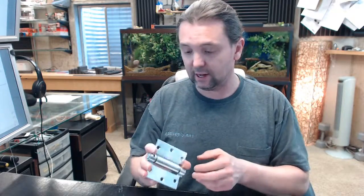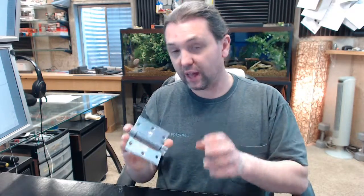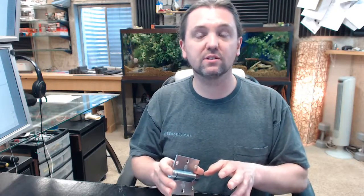I prefer hydraulic control over a door, like a door closer. But you're not going to install a surface-mounted door closer on your bedroom door. You just want the door to close. That's all there is to it. You'll find greater success when you've got more spring hinges rather than less. You can certainly always add them later on should that prove to be true.